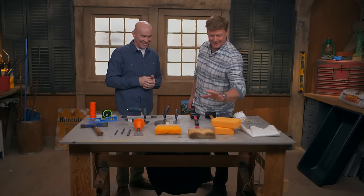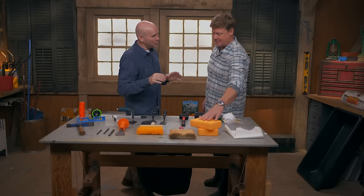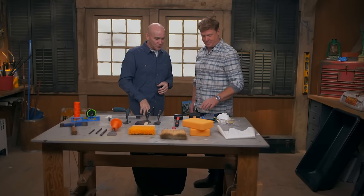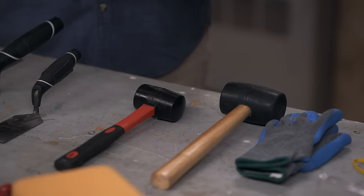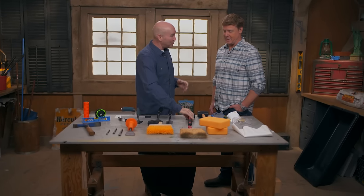More cleanup, obviously. My favorite tool — the sponge. Everything looks neat and clean when you're done. These rubber mallets right here, they're perfect for brick walkways that are based in sand. Sometimes they settle, so we'll pick the brick up, we'll put down more sand, tap tap tap with a rubber mallet. That way we don't damage the brick.